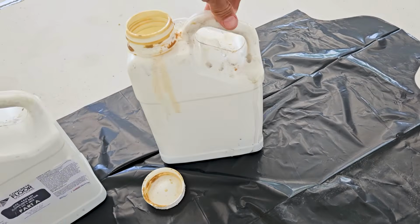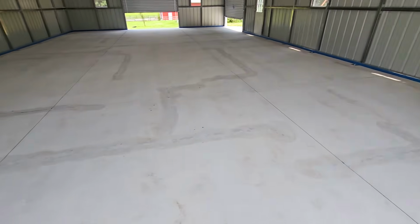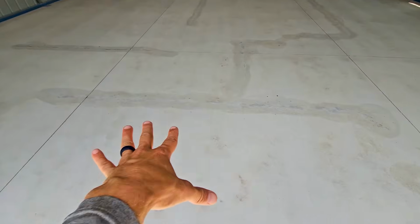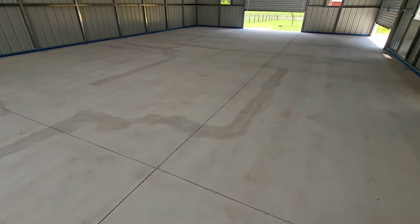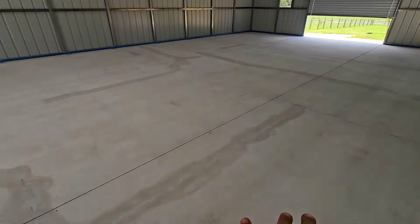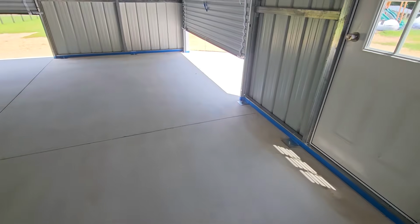All right, let's go. Alrighty, step 3 of 4, complete. That's it, down to the white cap. We got everything ground down. All the touch-ups and cracks have been addressed with the 2-part polyurea crack fill. Came back through one time, got the scratch coat we need on top of the cracks. Transition lines have been cut.